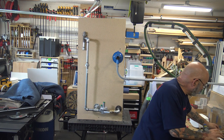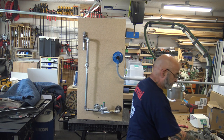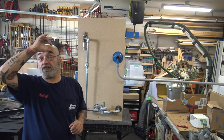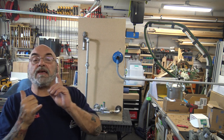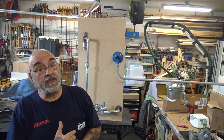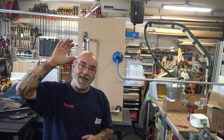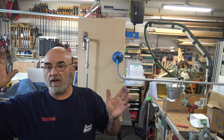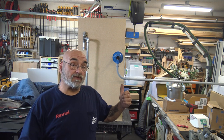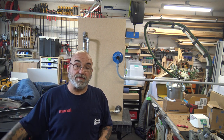But you need to be, let me just take this little thing off. I don't want to break that in there. That is my one regulator we keep for when we do the commercial kitchens. Okay, you need to be at least 5 feet away from a source of ignition. You need to be 5 feet away from a door or a window. And that window is something, if it's a glass block window, if it's a window that doesn't open, you don't need it. But if they open the window, this regulator expels gas. It goes into the window, goes into the door. So you got to be 5 feet away.